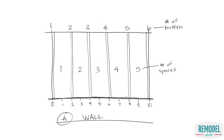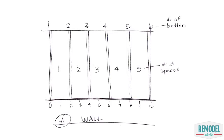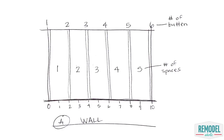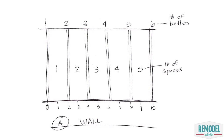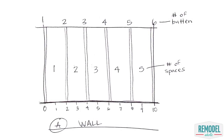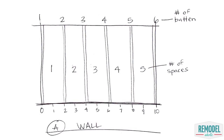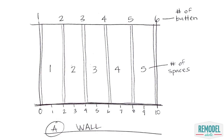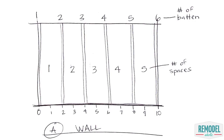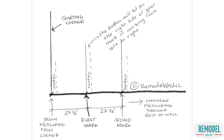Let me break it down for you — and don't be afraid to grab a pen and paper and sketch it out too. First, divide the length of the wall by the approximate spacing you want. For example, if you want battens about every two feet on a ten-foot wall, that gives you five board spaces but six battens, since you'll want one on each end. Since we're determining the distance between the battens, we can't forget about the width of the battens themselves, so multiply the width of the battens by the number of battens. For example, a three-inch batten times six battens is 18 inches.